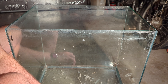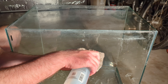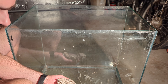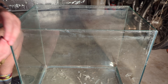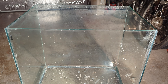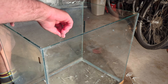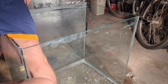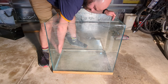After you've scraped for a while, you'll get to a point where you just can't get the last of that old crusty silicone off. At that point, bring in acetone. Douse a rag with acetone and wet down the area before taking a blade to it again. After scraping, come back with a watered-down rag to remove any remaining acetone — it's a very strong chemical that breaks down silicone, which makes it easier to clean up, but if large amounts are left on the silicone holding the glass sheets together, that's bad news.